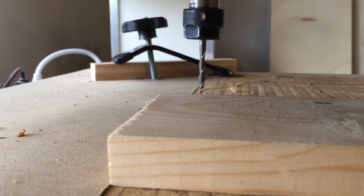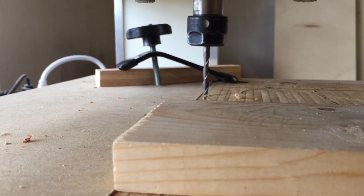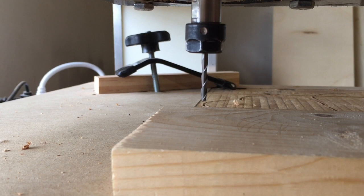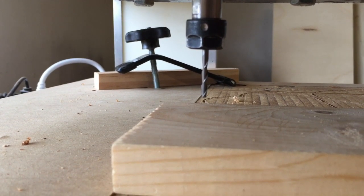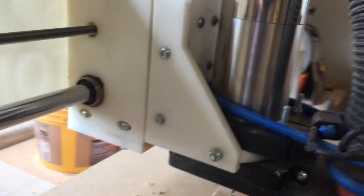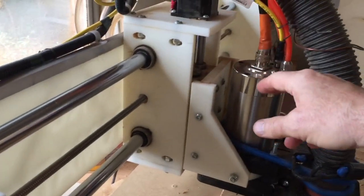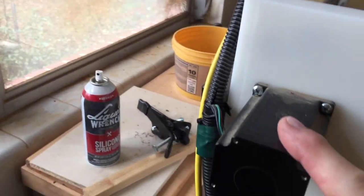One of the things you'll find that you need to consider is the rigidity of the machine you have, because this is the very first Shark model that was made. I still use it. I got it 8 or 10 years ago, and it still works fine. I have an HD3 and an HD4 and an HD2, but this was before the HD designation. And I modified it so I could put this on it. I went to larger motors, and I went to a new drive under here.